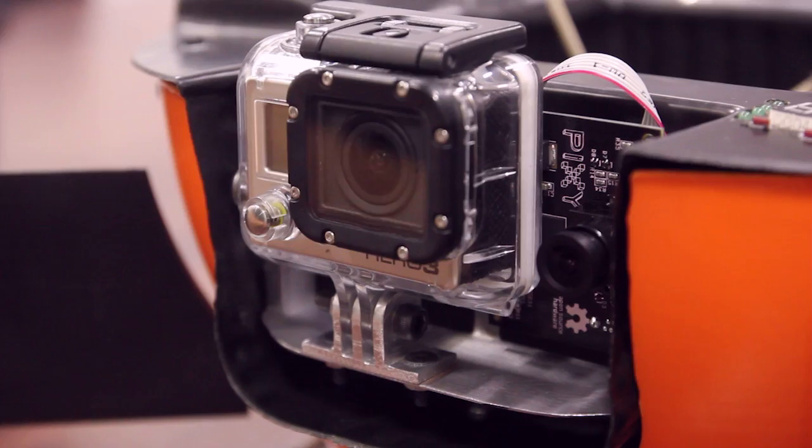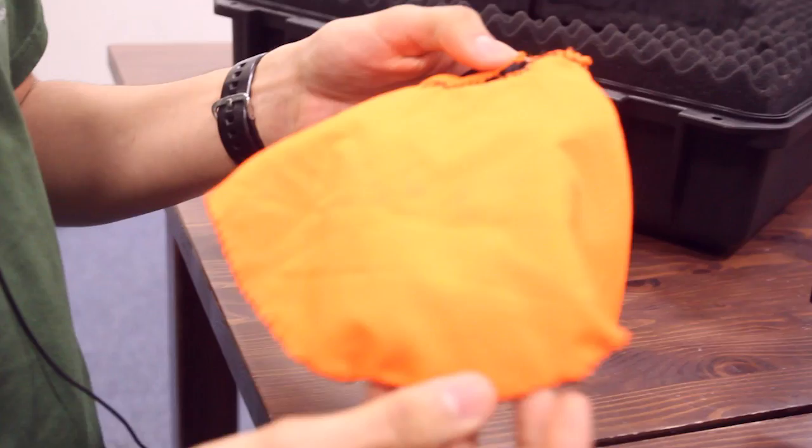This is the final robot. This is the new piece — the vision sensor. That's connected to the microprocessor, and that's what tells it how much to correct for terminal velocity and position. This is a glove that we modified with a very bright colour fabric, and that's because the vision sensor actually tracks colour, not shapes. So it's going to try to keep the orange dot in the centre of the field of view.